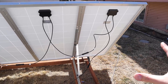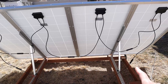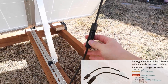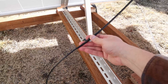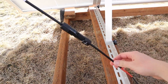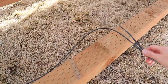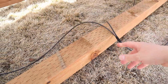All the wiring connections on this solar panel array are waterproof because they use MC4 connections. Because they're wired in series, I have two leads — a main positive and a main negative. This is an MC4 pigtail I bought on Amazon, soldered and heat shrinked to 12 gauge landscape cable. The positive pigtail has red heat shrink. I have UV resistant landscape cable that runs into my basement through the bottom of my door jamb — it's about 40 feet long and works really well.